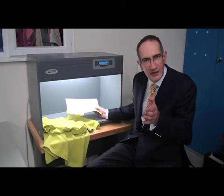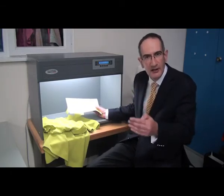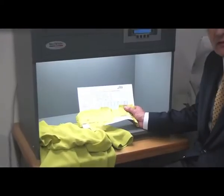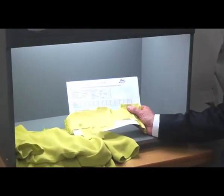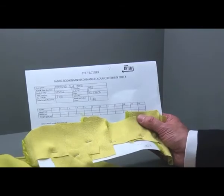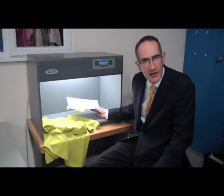The fabrics need to be checked under all three lights, and each roll and each colour needs to be recorded on a colour continuity card such as this one. It makes sure that the panels within the garments match each other, and also garment to garment there is no variation in colour.